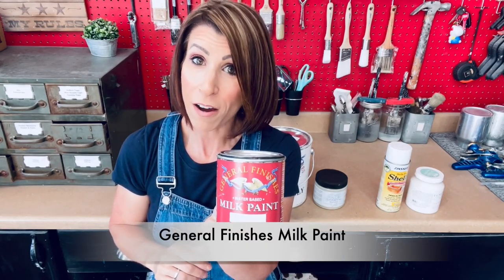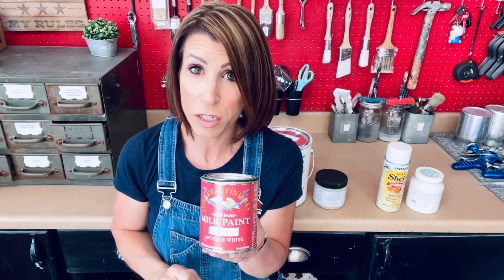Here is another product that I really, really like — General Finishes. They are the ones who actually put a warning label on their whites. This is their antique white, but on their snow white they actually have a warning label right on the top that says do not topcoat this white. This is not a paint and topcoat in one — they don't claim that. What they tell you is this is a self-sealing paint, therefore it's very durable and doesn't require an additional topcoat. I've done hundreds of pieces in General Finishes milk paint without a topcoat, no problem. It is a very durable and wipeable paint, and for high traffic areas they recommend a topcoat, but they do warn you on the whites not to do that.